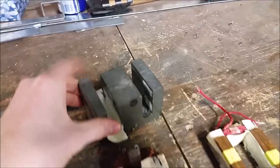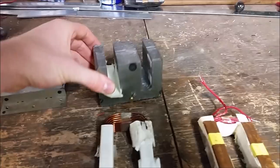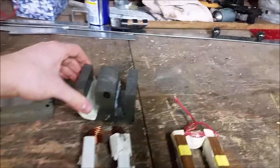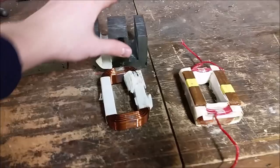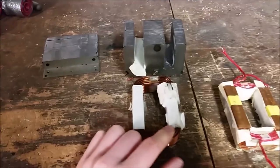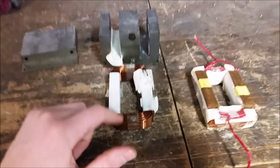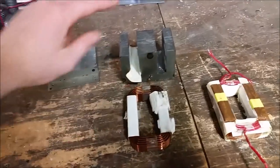Once the top is off, you'll have your main core and two coils or windings inside. They were pretty difficult to get out. I put some WD-40 down into the cracks to try to loosen things up, then tried using wooden wedges along the outside of the core to separate the two coils. Make sure you don't damage the coils — if you damage the enamel on the windings, it might not work. Use wood and take your time wedging back and forth to pop the coil off.